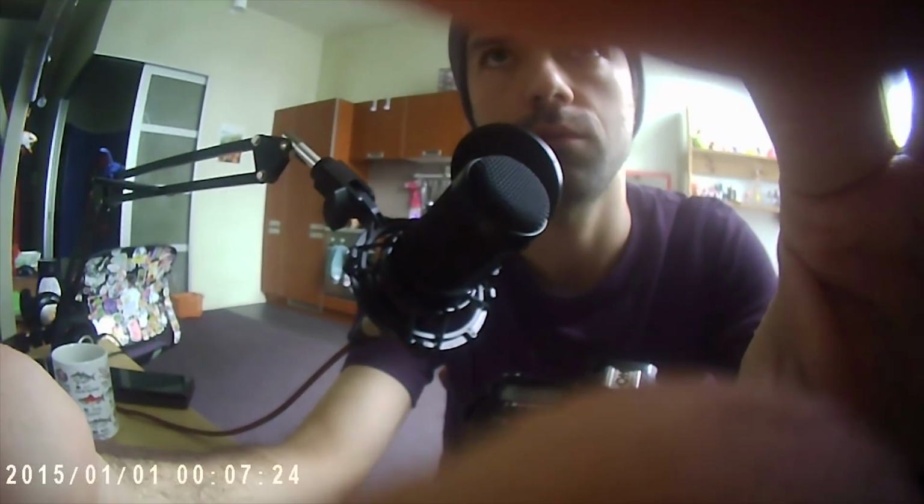You can use this as a webcam and basically focus it by looking at the picture on the computer. So the camera is connected in webcam mode. You can see the video is blurry. What I'm gonna do is twist the lens carefully until everything in the distance comes into focus. Just like so. You can already see just how much better the field of view is compared to the original lens. Now there are still some issues with the camera.